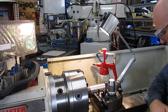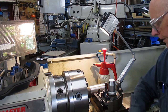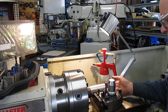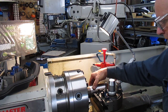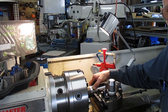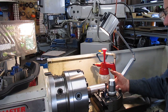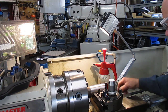Welcome back to Bruce's shop. This is the third in the series of making an adapter to fit my geometric head to the tailstock. I've completed machining the internal bore — the smaller bore that's going to go on the shank of the geometrical die head — and I've also completed machining to final diameter the one that fits onto the tailstock.